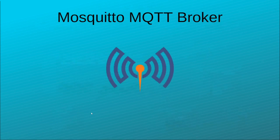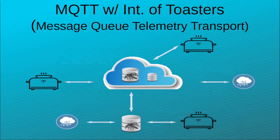Okay, so, MQTT broker. MQTT sits in the middle. It is a network service. It's just software. Its job is to accept messages from publishers and send them to their subscribers. It's kind of like a magazine service. It does this with topics which kind of look like system paths. So if something subscribes to a topic, anything that's published to that topic, it will get. Devices can be publishers, subscribers, or both. And they can do it to multiple topics, depending on how many resources you have. Little devices tend to have only a few small topics. A Raspberry Pi could subscribe and publish to all of them.